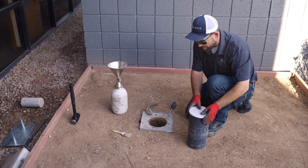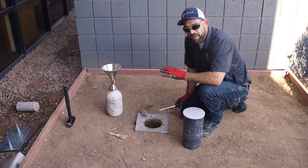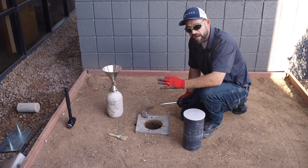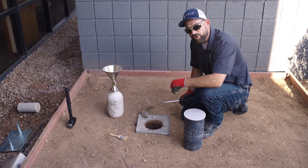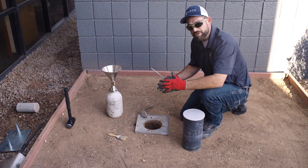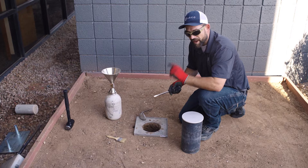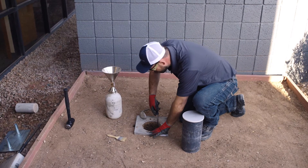The typical depth of these holes is approximately six inches. The method has a requirement for a minimum hole volume based on the largest diameter rock in the material. The larger the rock, the deeper the hole you need, because that will be more representative. The larger the particle size, the more likely you are to have less representation in a smaller hole, so you go for the larger hole.